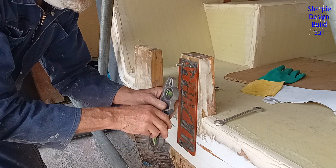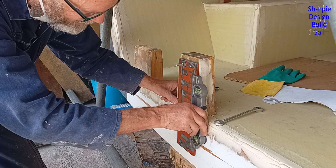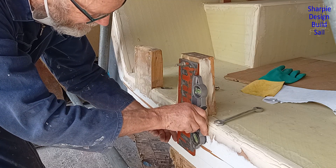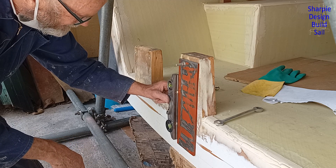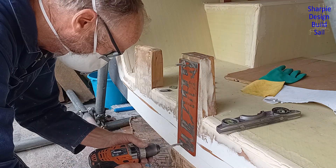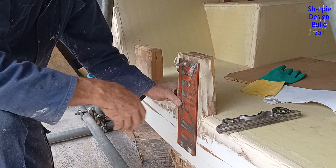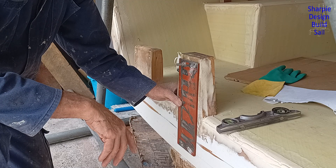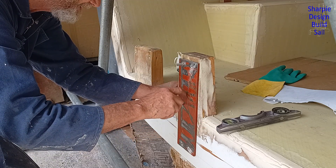This is pretty much how I've turned over all my boats. I used to turn over the steel boats I built using a similar method — putting a bit of pipe out each end as a pivot point. On a steel boat it's quite easy: you just weld it with braces to the hull and you can grind it off — like it was never there. The boat will definitely want to roll back down, so I'll have to restrain it tomorrow. I'll need to be able to put G-clamps on here, so I'll probably put the pipe in this area somewhere.